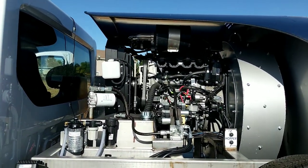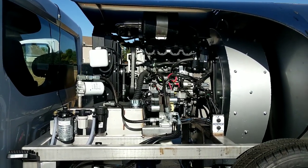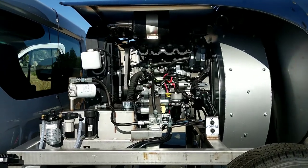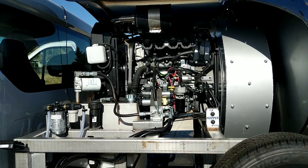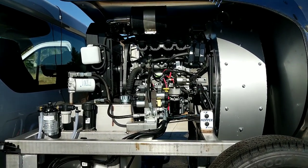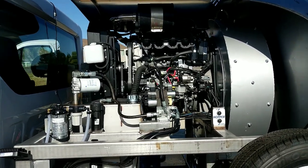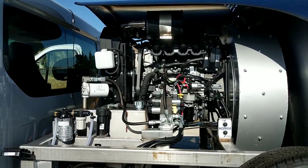This is the Ford MSG 2.5 — a very price-friendly engine. It really doesn't cost but a couple hundred bucks to step up to this from a 1.6. It has a really good torque range for running at 1200 to 1500 RPMs — at 1600 RPMs this engine is in a great torque range.